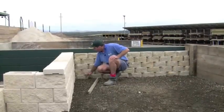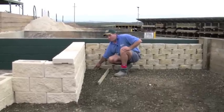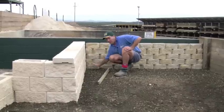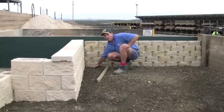Say you wanted your pavers to finish level with this course here. If you had a 40 millimeter thick paver, you'd have to come down 40mm for your paver, then 25 to 40 millimeters for your bedding sand, and then a 100mm of compacted road base. So if this was the finish height you wanted, you'd have to excavate down about 170 to 180 millimeters from that point.